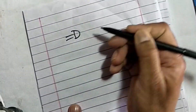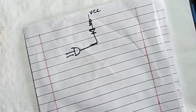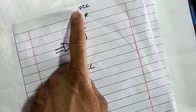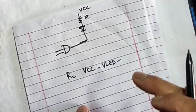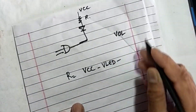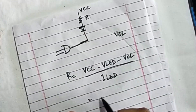If we have any type of gate and we want to connect an LED to its output, we connect VCC here. The formula is: R = (VCC − VLED − VOL maximum) / ILED. VOL in the datasheet is 0.5 volts — that is the output voltage in the low condition. We need to limit the current for this LED.